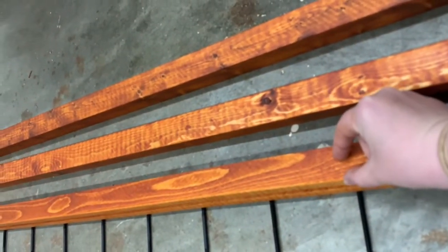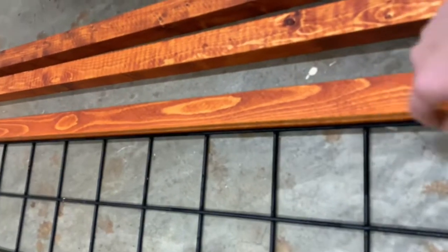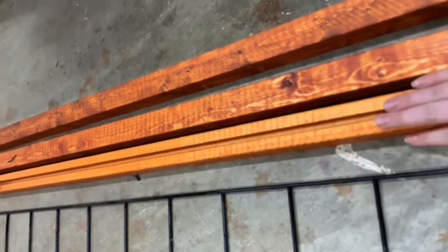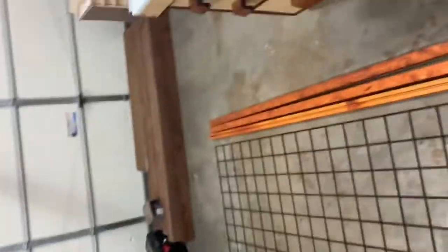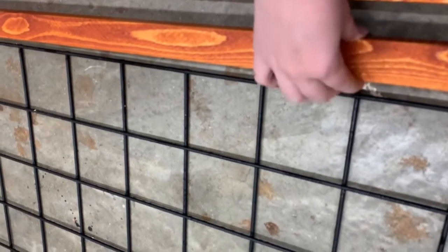The depth of that cut is only half an inch. So when I go in here, I'm going to go half an inch deep and I have some excess. Now something you might not know about 2x2s and 2x4s — something I learned on this project — is that they are not actually 2 inches by 2 inches as you might think. They are actually 1.5 inches by 1.5 inches. Same with the 2x4: it's not 2 inches by 4 inches, it's 3.5 inches by 1.5 inches.